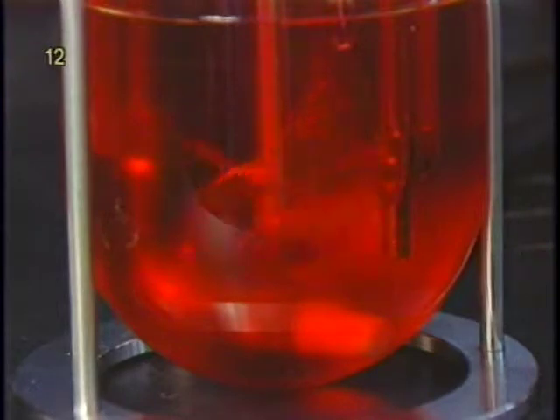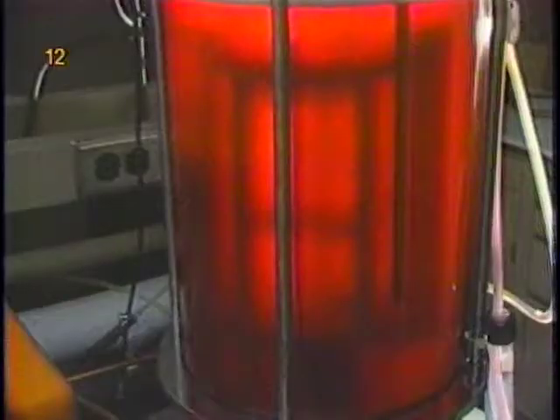Typically, the airflow rate ranges much below 0.1 volume of air per volume of liquid per minute. To decrease the airflow rate, often oxygen-enriched air or even pure oxygen is used to increase the driving force for oxygen transfer. The terminal rising velocity of these bubbles is usually small, and small layers of foam often accumulate at the liquid surface. In a large-scale fermenter, this does not seem to have a detrimental effect, and the accumulation of microcarriers on top of the foam is not problematic.